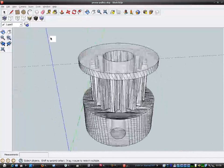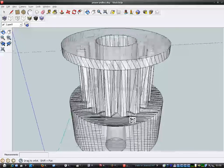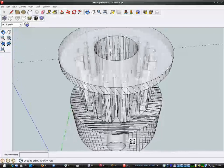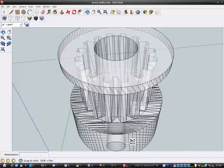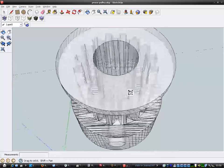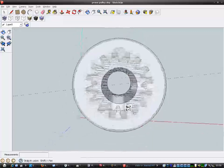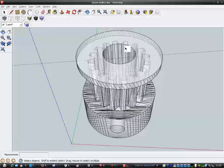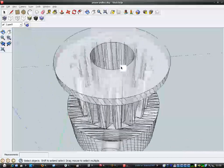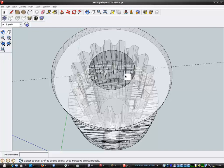But the one I 3D printed didn't come out exactly the right size, so my X is slightly different to my Y right now, so my objects are printed a little bit oval shaped. Well, I expected that, but it was worth trying it out. It was alright for doing some tests with, and plus I can use them as 6mm wide belt now. The print's just finished, and it's not that bad. It's a little bit oval shaped.